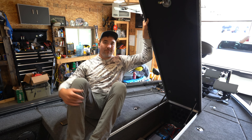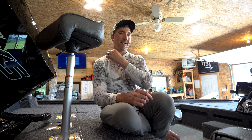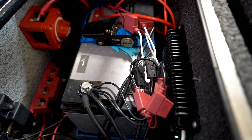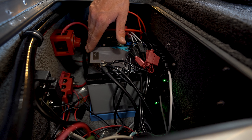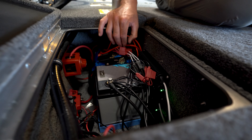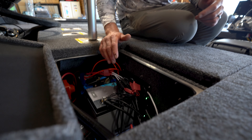We'll head to the back here and show you the house battery. Last but not least, we've got a lithium 12-volt cranking battery. This is a new thing for me. I've had one in the last few months in my old boat and really haven't had any issues, which is not that common for me in a year. Usually I've got some form of issue, especially with my house battery at some point. But this is a 100-amp-hour 12-volt Powerhouse lithium. It's nicely mounted in here - you can get these high-end aluminum trays with good straps, not just the cheap plastic ones. I want everything secure back here, especially heading to Lake Ontario. I've got bus bars, on-offs, and everything like that back here.